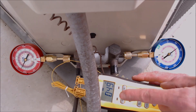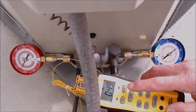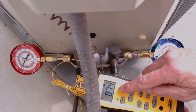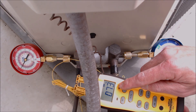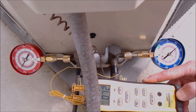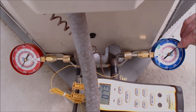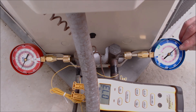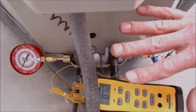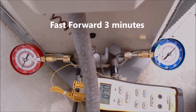T1 is the suction line — the actual vapor temperature on the suction line. T2 is my second temp sensor on the liquid line, reading 73 degrees presently. We can tell that the vapor saturated temperature in the evaporator coil is above 32 degrees — it's actually at roughly 40 degrees — so we just have to wait our five minutes and then check subcooling.